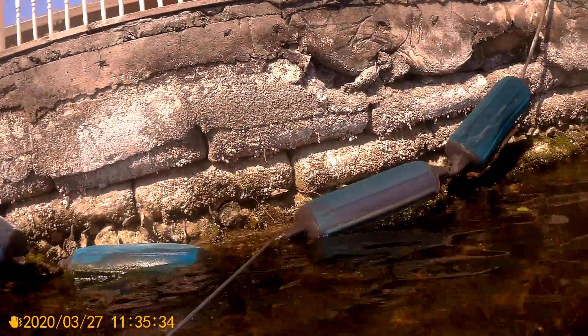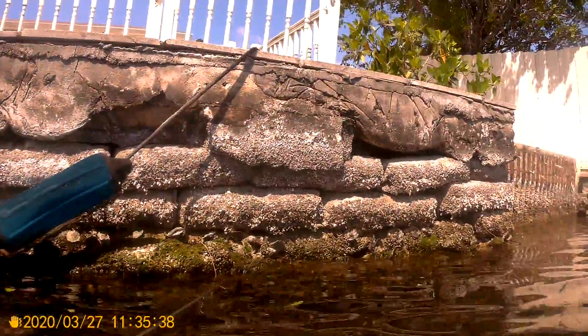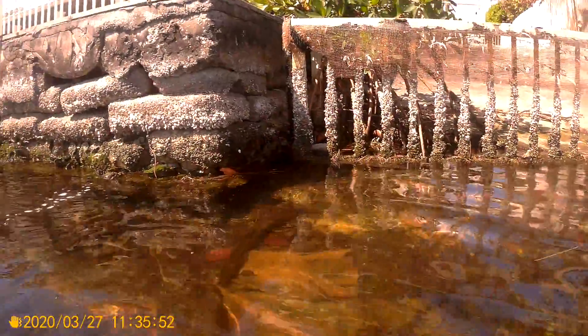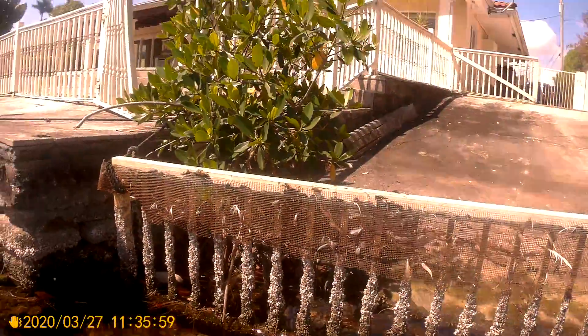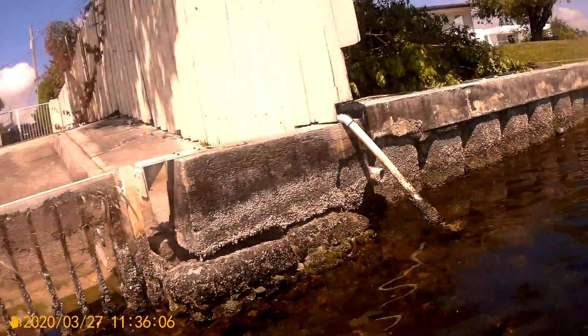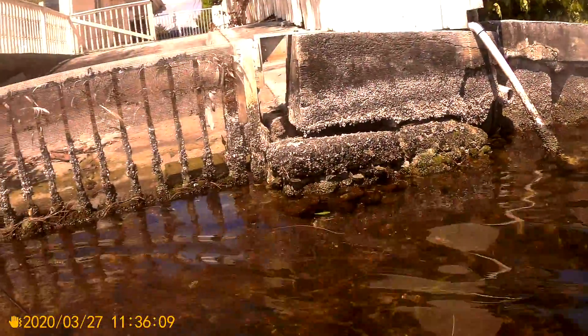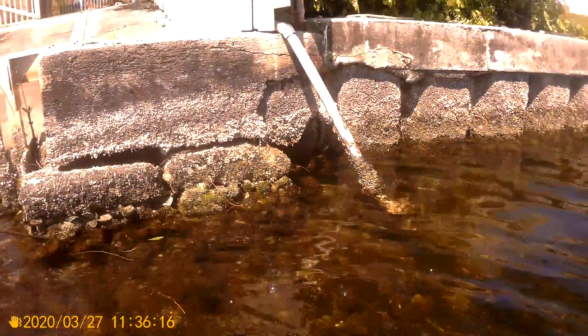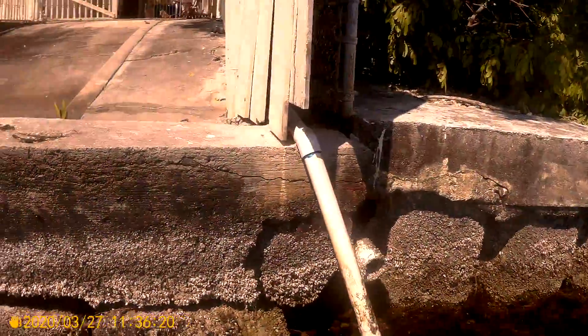Where that poured-over slab is, it has all just cracked because of containment issues. The probe goes way past where the bags are. Coming up to the boat ramp feature of this property — the slab of the boat ramp gives about 2 feet of rotation, so reinforcement work would be good here. Probably inject some foam underneath the slab to stabilize it, because it shows settling — it's completely in the air, floating over the bags, and as a result it's stressed and cracked.